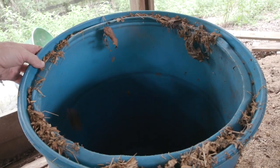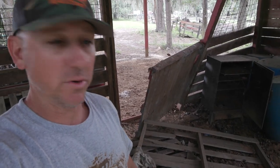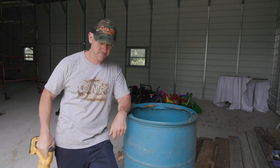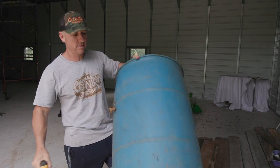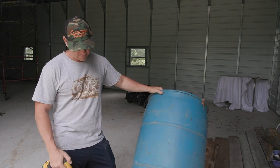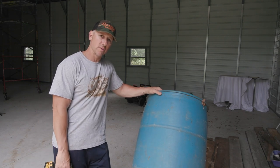You can see there's no top. There's a ton of old wood from the barn — we've got pallet wood right here. I think I have all the materials to make this thing. It should be pretty simple. This is a simple process with a Sawzall. I thought I'd have to mark it, but the barrel actually has fill valves and a seam that runs all the way down, matching on the other side. So I'm just going to cut that seam on both sides, flip it on its side, go in a straight line on the bottom, and that will essentially be the ends for the feed trough.